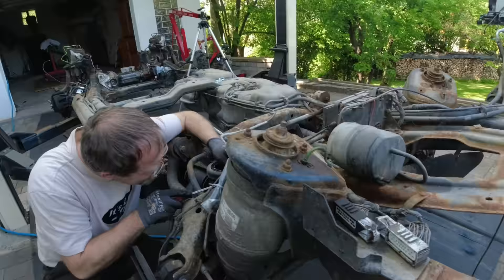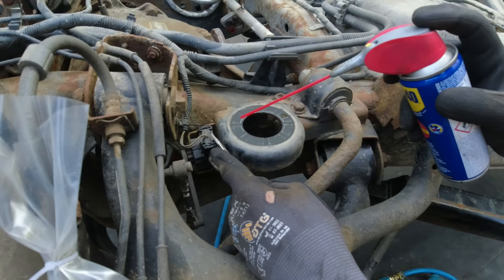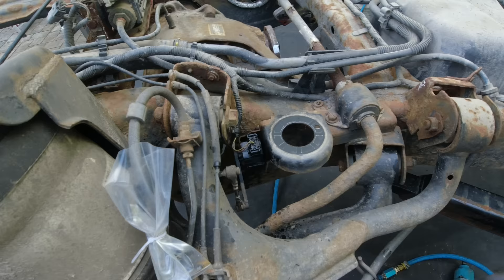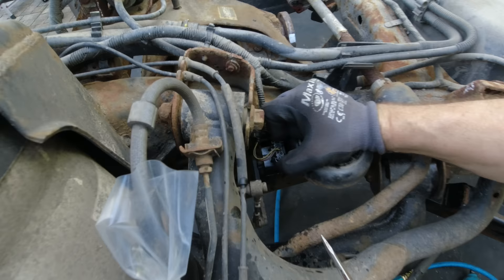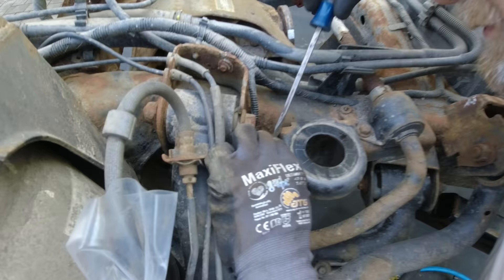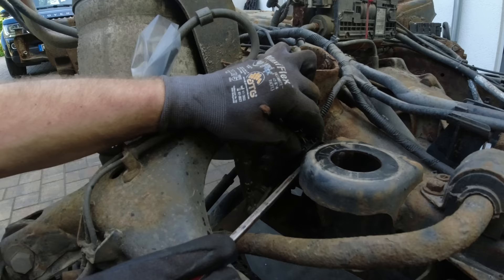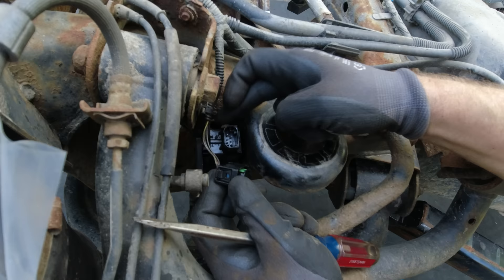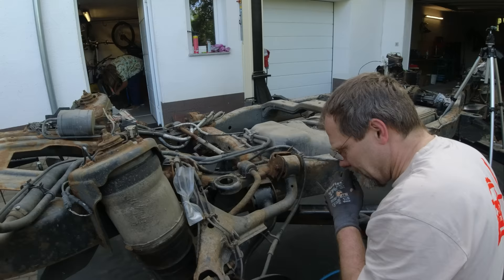It's dust and it looks like new underneath. Christian has problems with 17-year-old switches and connectors and plugs. If you've got an old connector like this which is really brittle and it does not want to come off, use some compressed air, because the latches are fully blocked with dirt. See how nicely they work now again? Now I can work this connector out — and probably break it because it's on camera. There — it's off. It looks like brand new on the inside; there's no reason to change this connector. It might be brittle, but you can always fix that in the Simpson Desert with a paper clip.